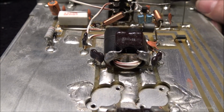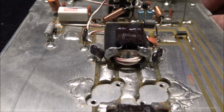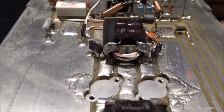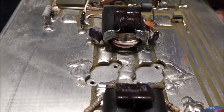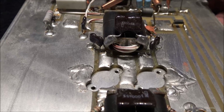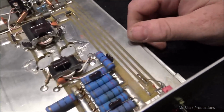These are the things you guys got to have your eyes open for when you're doing rebuilds and working on your own stuff. It's not just as simple as popping the transistors out and changing in other ones or putting new power wires in it. You got to be able to look at the overall picture. So, okay, we got it defluxed, and now I'm going to go in there and chamfer them holes out and get them all nice and beveled down and cleaned up.